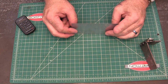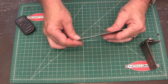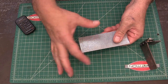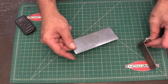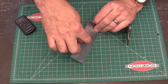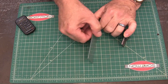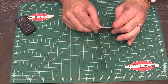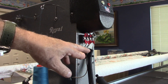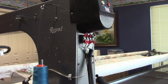My next step was thinking about spring steel. I don't have large spring steel, but I do have sheet metal — it's flexible in one dimension, but if you orient it the other way, it's not flexible because it's so wide. So I took a piece of steel, welded it on the end, put my magnet on there, and it had just enough flex to bend and let the magnet stick — this was the ticket. I then added a little terminal block on the back of the sewing machine that connects the 12 volts, the switches, and the magnets all into one central location.